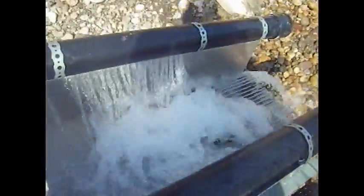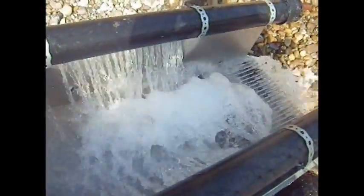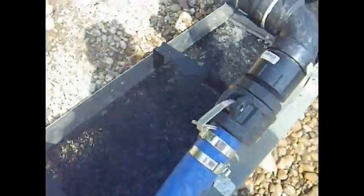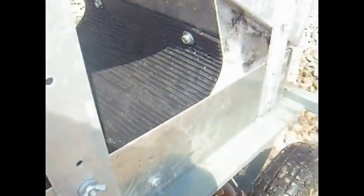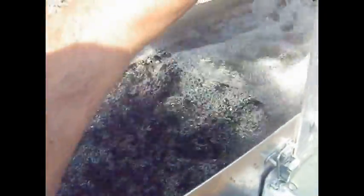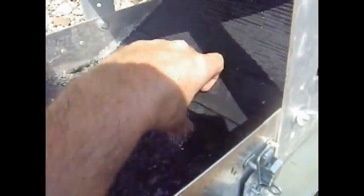Active spray bars, falling through. It's really nice to shovel into, very consistent. Here's the end of the sluice — it's not a lot of water, not very deep at all. Let's have a look back here where it's dumping all that turbulent water. Look at the air bubbles and the turbulence coming off the slick plate. As soon as I put my little mat down, it almost stops all of it. Look how nice and flat everything is.